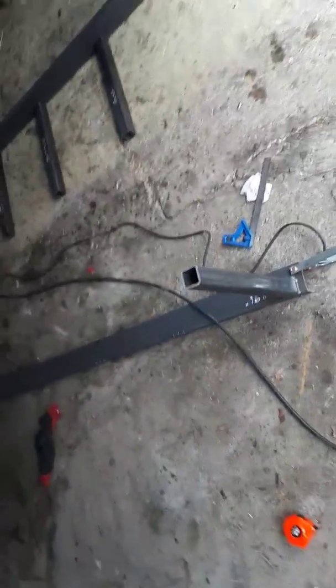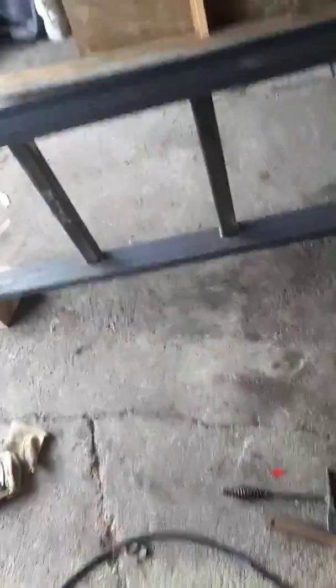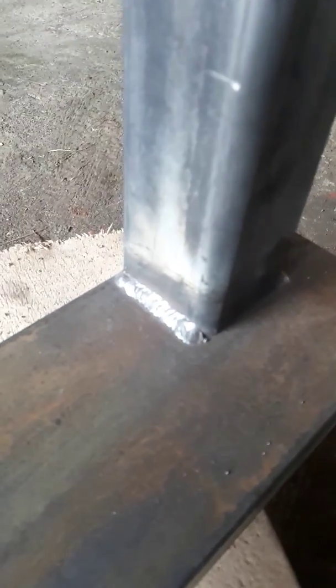This is going to be a pretty heavy unit — I'll need a helper to move it into place when I'm ready. This is as far as I'm going to weld it. It's not a super heavy project and this is way overkill. There's the weld on each side, top and bottom. I flip it — no point doing overhead welds if you can flip it and make it easy for yourself. You get a much better weld when you're relaxed.